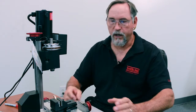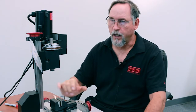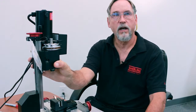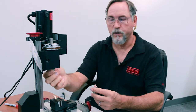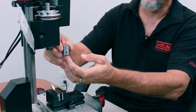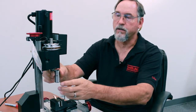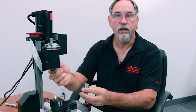Okay, for your end mill holders and anything else that goes onto your spindle, if you want absolute perfection, the closest you can possibly get, then what you want to do is come in here and just take a skim cut on the shoulder face. Now, when you do that, you are now cutting that shoulder face dead true to the assembled headstock. Okay, and then everything else that you put on there should run truer because you have a perfect surface. As an example, a 3/8 end mill holder, this guy right here, is about an inch and 1/2 long. If there's a little variation on that surface, your run out here is gonna increase the run out at the end of your end mill holder. The longer the end mill holder, that same interference variation is gonna have more run out at the end because it's sticking out further away from where that interference, that variation is, okay?